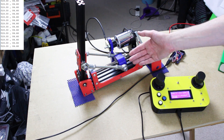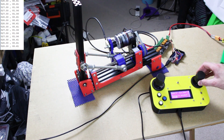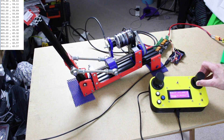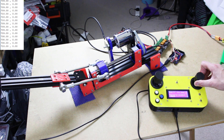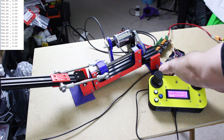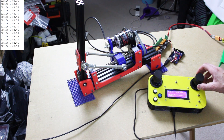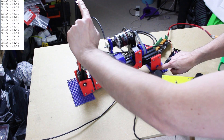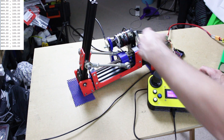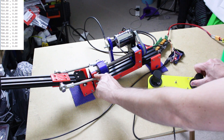Now we've patched that through and put the code on, so we've got the Arduino Mega actually driving the O-Drive. There is that jitter but it will actually track the stick — the motor's pretty torquey and it's going there and stopping immediately. We definitely need some motion smoothing because otherwise it's shaking itself to pieces, but it is tracking the motion. I'm demanding a leg length of around 710mm, the actuator's at zero which is correct, and if I were to measure from the foot we actually do have about 710mm. As I go up, making that leg length shorter, we can see the actuator length getting shorter. We've hit the end stop — I've been a bit conservative but we could go further.